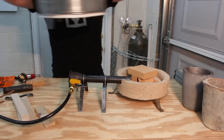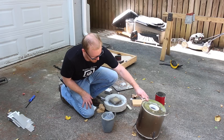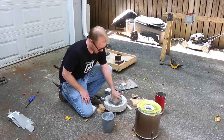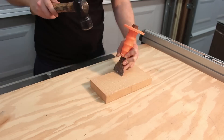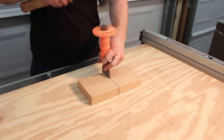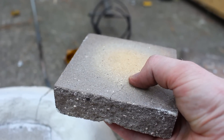Things have not been going as smoothly as what I had hoped. I do like the design of the lid — that thing is working really well. The base, however, is pretty bad. It's cracked ridiculously. The new plan is to take another pot and flip that upside down, use some more of the ceramic fiber insulation on the bottom along with the fire bricks, which seem to be holding up okay. There's a little bit of cracking on one where I split it, but we'll see how they hold up.